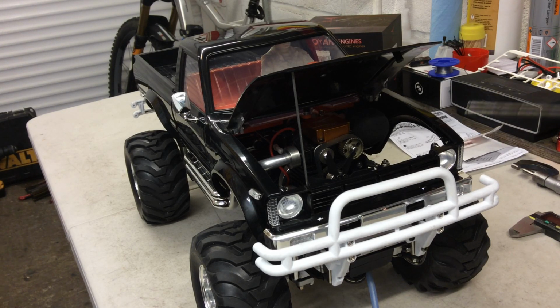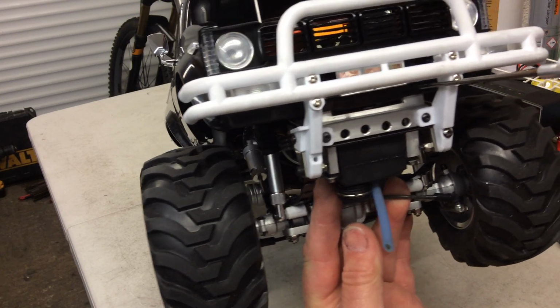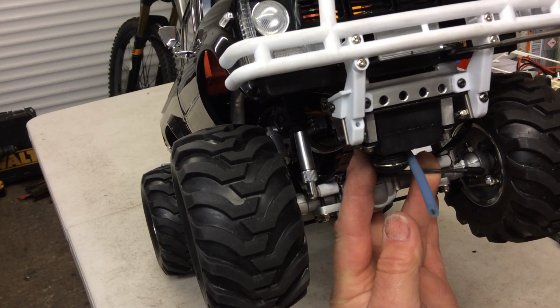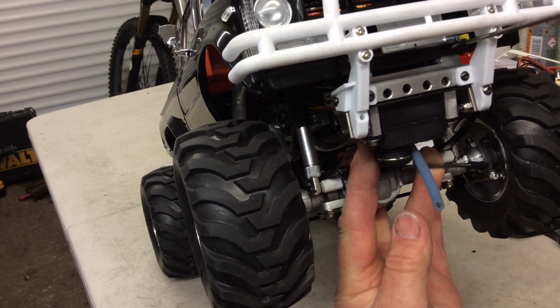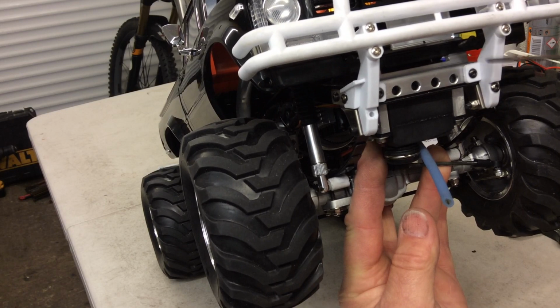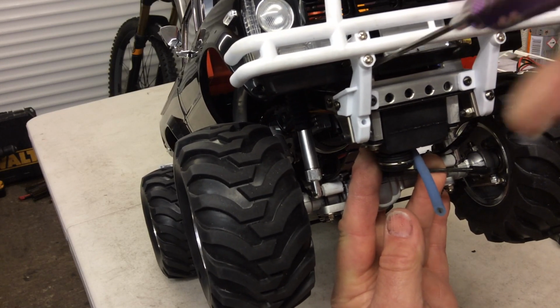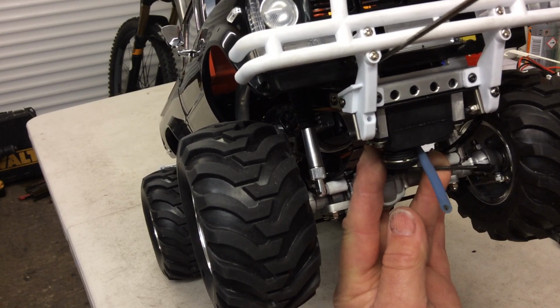I don't know what's going on there, but yeah, I had a lot of different setups for mounting this body on, but in the end what I've done is I put a little bracket under here, and I've got 2 screws in here. I made 2 of these brackets because I had to anneal the alley. I couldn't bend it, and the first one I made, it sort of cracked, and I thought, well, it might be all right, but no, I'll make another one. So again, hours and hours making another bracket.